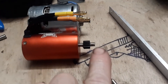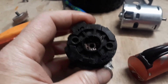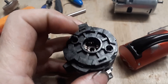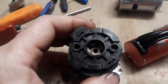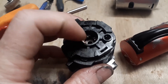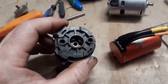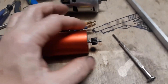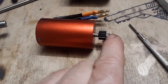The shaft on the Red Cat Racing motor is a little bit longer, so I'm gonna have to trim some of it down. Inside the transmission you can kind of see a hole in the center — I tried drilling that out, but whatever metal they make these gears out of is some hard, hard stuff. I have drill bits specifically designed to cut metal and I have no idea what that stuff is — some sort of hardened steel. The drill bit just squeaked no matter how slow or fast. I give up on drilling it, so I'm gonna hook my brushless motor up to the ESC and grind this down to probably about three millimeters so it can slide inside that hole.